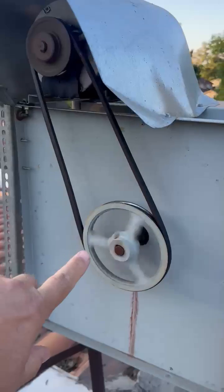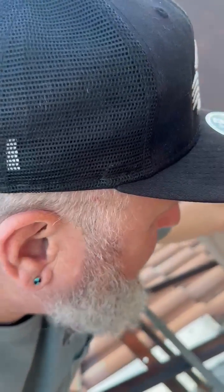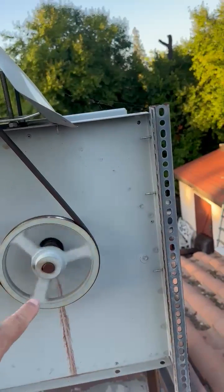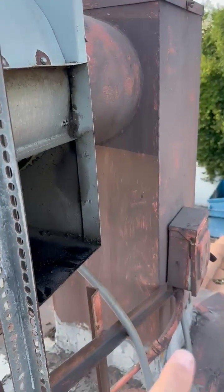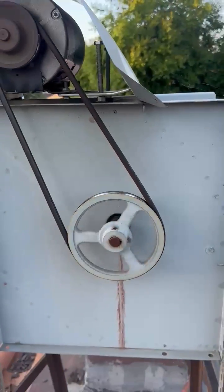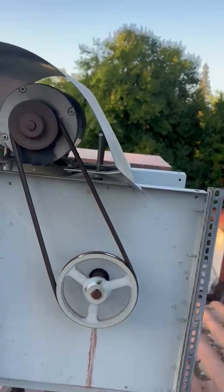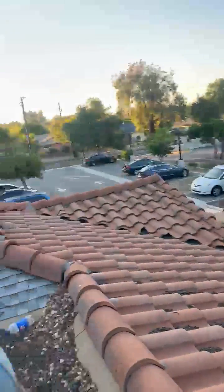The thing I noticed is the rotation of the fan. I'm going to shut it off. Notice that the fan is spinning this way — the outlet is here. This fan actually should be spinning the other way, but it's not.